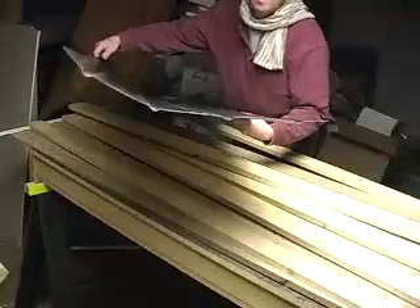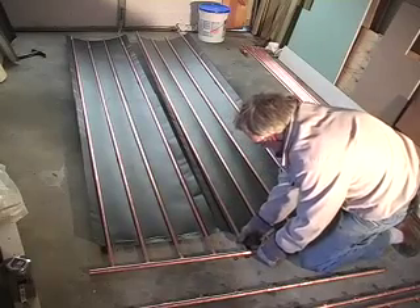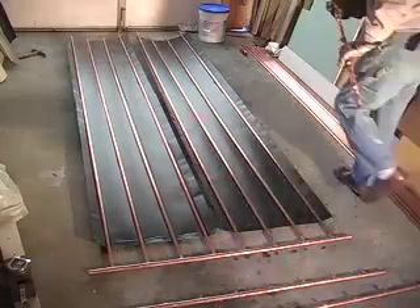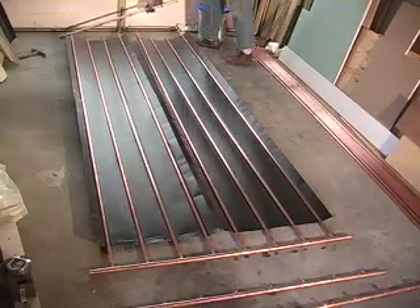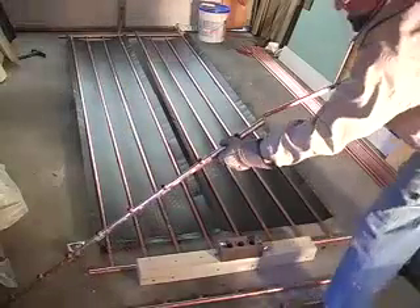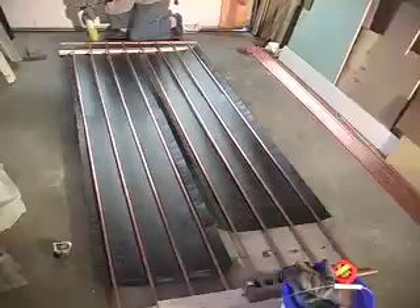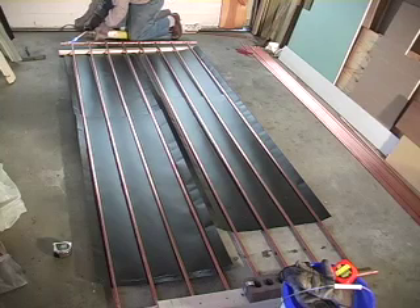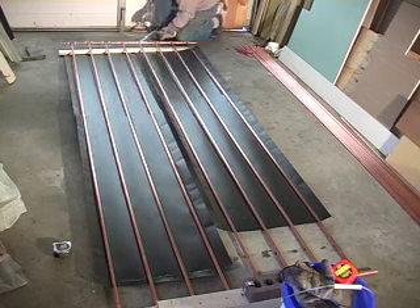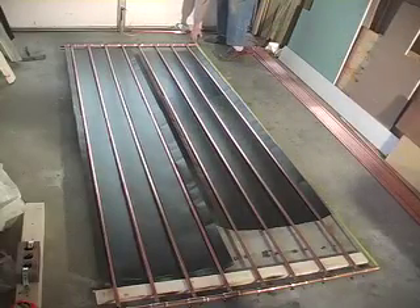There it is. I'm going to be putting those on. Here they are — I'm using them as gauges now to show you how to put them into the three-quarter-inch copper header. If you're not very good at this stuff, don't make them. I was barely going to make my own, but I wanted to. They are $700 a piece — last time I checked, that's August 9th, 2009. This is a four by ten; it's a little bigger because I'm using ten-foot pipe, but you can buy them for $700 a piece. I'm making three. I basically advise you to buy them and fit them on the roof if you've got the skill, because it does take a lot to make these joints. I had no leaks. The way I test these is I put three-quarter-inch shutoffs on each end and fire the hose into one end and put them under pressure to see if I have any leaks. You want to measure them all the time because these three are going to have to fit each other when they go up on the roof.